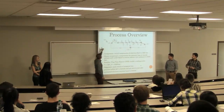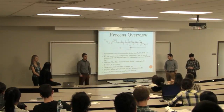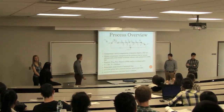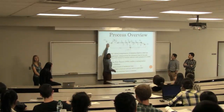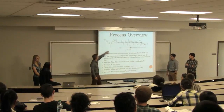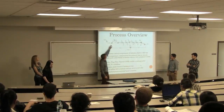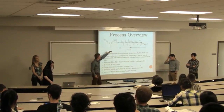We start with it's just monomer ethylene cut with some benzene, some hydrogen. That's just at atmospheric temperature and pressure. We send it through an initial compressor that gets it to about 1,500 bar. We then meet it up with our recycle stream, because we do get some pressure loss that I'll talk about in a second. And that gets fully compressed to our operating conditions of 2,000 bar.